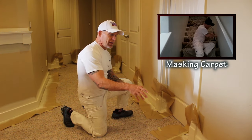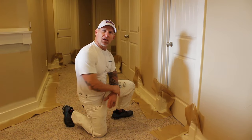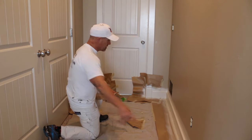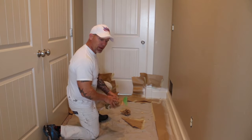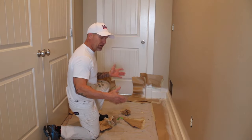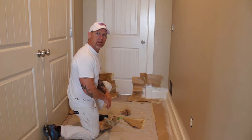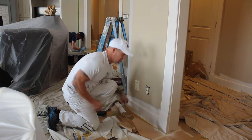We've got it all masked here; we've sprayed these baseboards and we're going to be rolling these walls and laying drop cloth down before we roll. Here's another situation in this hallway — just running nine inch paper with inch and a half tape on the carpet, covered with a drop cloth. We're going to be rolling the walls here too, and any spots that aren't filled in when we get to rolling, we'll just run some paper there and cover that up.